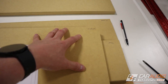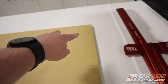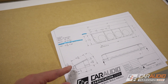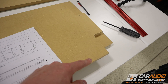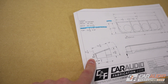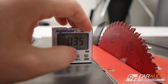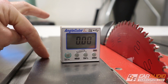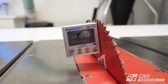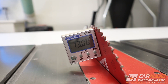I've cut four boards so far: the front, the back, the baffle that mounts the subwoofers, and the top. Each of those pieces is going to require an angle to be cut on them. After all, the top of this enclosure has an angle, so when I cut each piece I made sure to oversize them so I can trim them to their final size with the angle. To get our angle exact, we're going to use one of these digital angle cubes. I'll zero it out on the work surface and stick it to the blade, then adjust until I get to my target of 13 degrees.